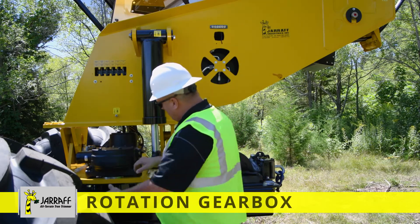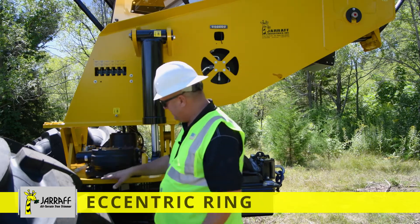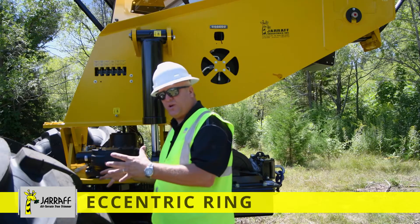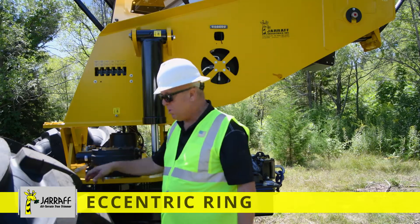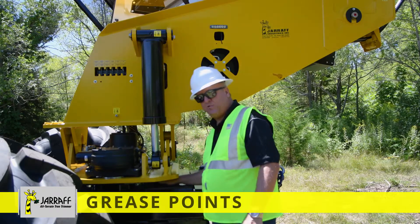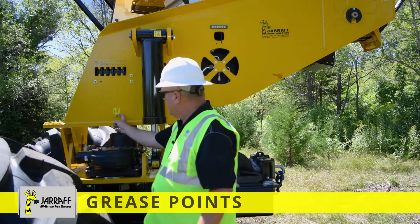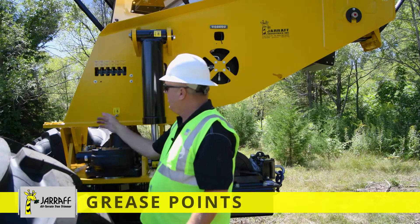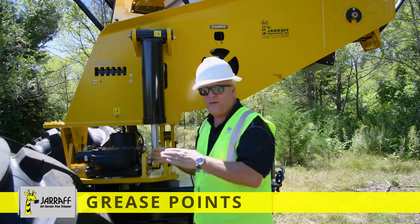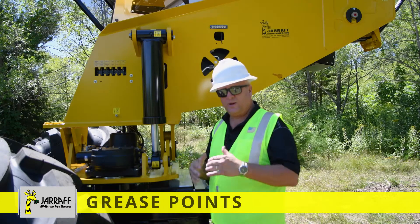The gearbox is bolted in with six Allen bolts, and to get the backlash set there's an eccentric nut. Basically, with the gearbox bolts loose, they tighten the eccentric nut down — it pushes the gearbox against the bull gear — and then they torque the bolts down. The gear we want to keep dry, no grease. The bull gear on the inside has ball bearings and loves grease. Come up out of the cradle and have somebody rotate it as you're pumping grease in to fill that big bull gear up full of grease — it holds about three to four tubes of grease when it comes from the factory.